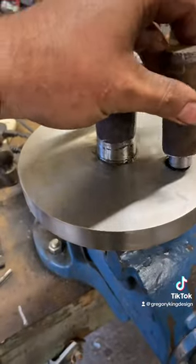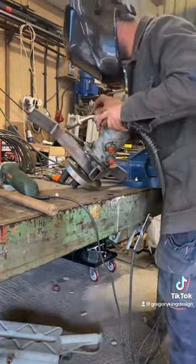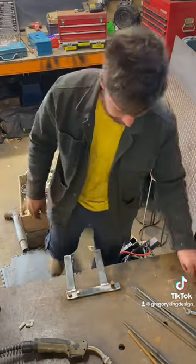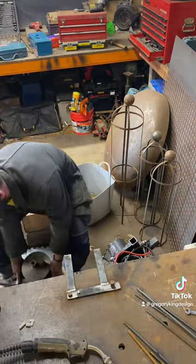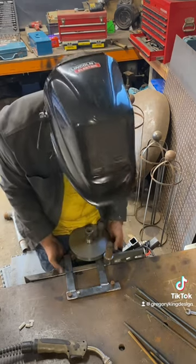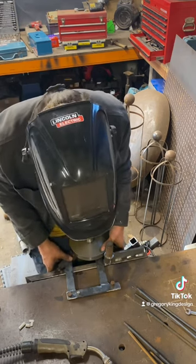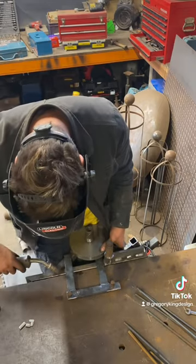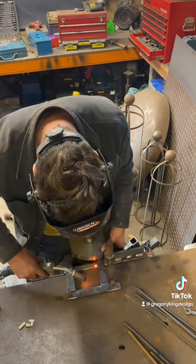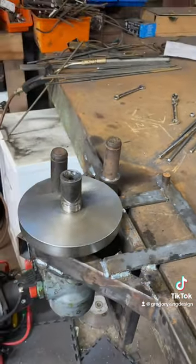That became a part. Using a piece of tube to pack out the top so it's the same diameter all the way along, with the track pin in there. Then it was time to make a frame to support it all. The idea is that this goes where the manual peg is on the edge of the bench and is removable — this frame mirrors the holes on the manual peg. I offered it up and tacked it in position so I can move it out of the way when I don't want it. The silver disc, which is my bending attachment, lifts off the keyed driveshaft and I can put different top plates on — some with scroll jigs or whatever — making it a rotary bender.